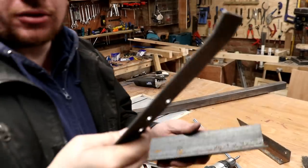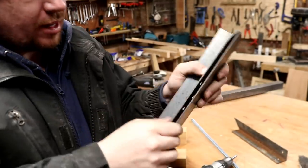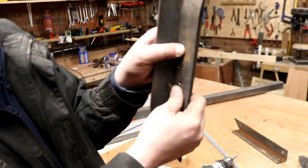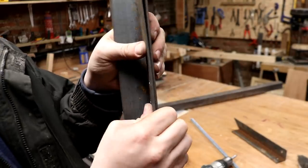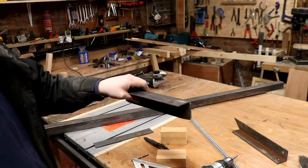Now this section throws me a little bit, but I've bent this piece of steel to sit onto the plate like such, and then we're going to press this down onto there where I've drilled these holes and weld that section on, and that's created a type of spring which should give us some pressure against the fence when we apply the lever.